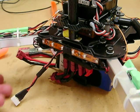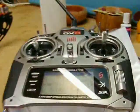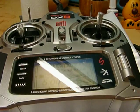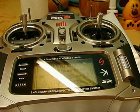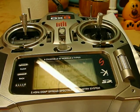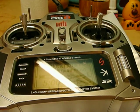What we're listening for is a musical tune. When we hear that musical tune, we need to lower the throttle stick on the DX8. So I'm going to put it high, then connect the ESC to get into program mode. The first time you connect it doesn't do anything; the second time you connect it does. But I'm waiting — as soon as I hear it start beeping like a musical tune, I need to put that throttle down.